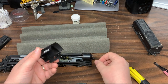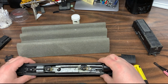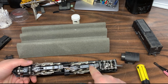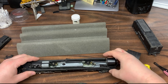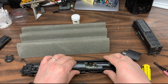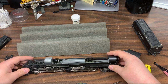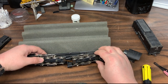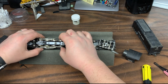There we go. These tend to kind of fall off — just watch that you don't lose them. And there is the inside. I've already lubricated these. You can also access them from the bottom, right here and here — that goes down into the worm gear for the drive. I did it from the top. They were pretty mungy and grody. You can spin the drive shaft here and check to make sure everything's running properly. Another thing I noticed is there are little bolts, and as soon as it started running, one of them fell off. So make sure that these bolts are fairly tight.